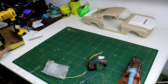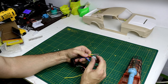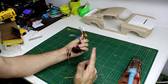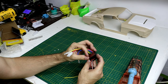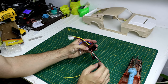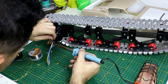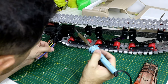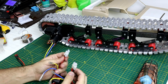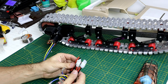I'm also going to change the connectors to XT connectors — T-connectors, whatever you want to call them — and I'm going to run it on LiPo batteries, so I have to change this. I'm going to cut both of these and connect them together since I'm running it on a single LiPo battery.